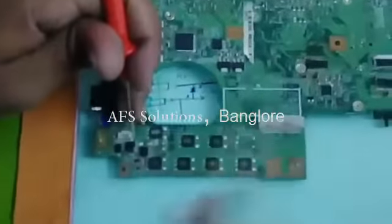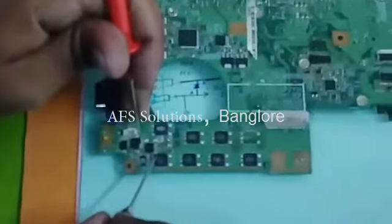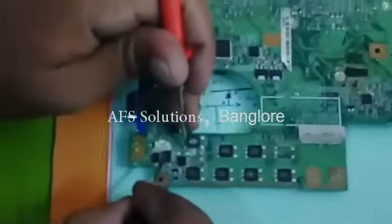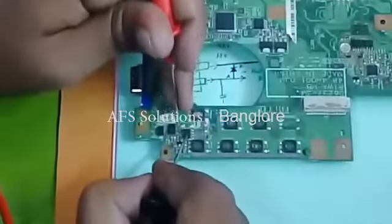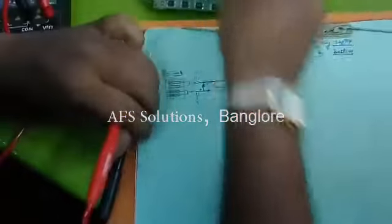Let us see the continuation, where this voltage is going. From drain, this is going to one more MOSFET. And this is the pin number 1 identification, and you can see one dot also. So this was the source, and here this is one dot and this is pin number 1 identification. That means this is a drain. Drain means all 4 legs will be connected. Okay, so let us do the drawing.